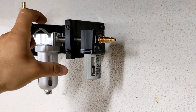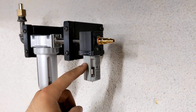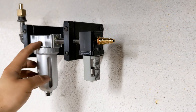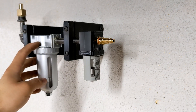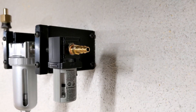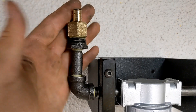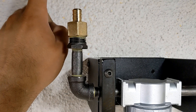When you look at this thing from the front, it is absolutely crooked. This is the first step of my compressed air system. I've got this filter here — I don't remember exactly what it does — and I've got this filter right after it which gets moisture and humidity out of the air. The air supply is going to come from a standalone compressor and hook in here with a short bit of hose. Air is going to exit the filters through this PEX fitting.